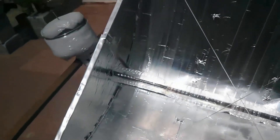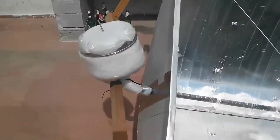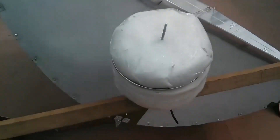This is not very optimized at the moment. The bottles as cladding around the pipe are sort of okay but not very good — I'm probably going to want to go with a thermosyphon action rather than just a single collector pipe. The reflective surface is not very clean, and finding a good way of keeping it clean with just water makes things worse. The pot's quite well insulated with polyethylene foam wrap, because it's not receiving heat directly. You can wrap it in whatever you want and it keeps heating well — it only cools down by about 10 degrees an hour.